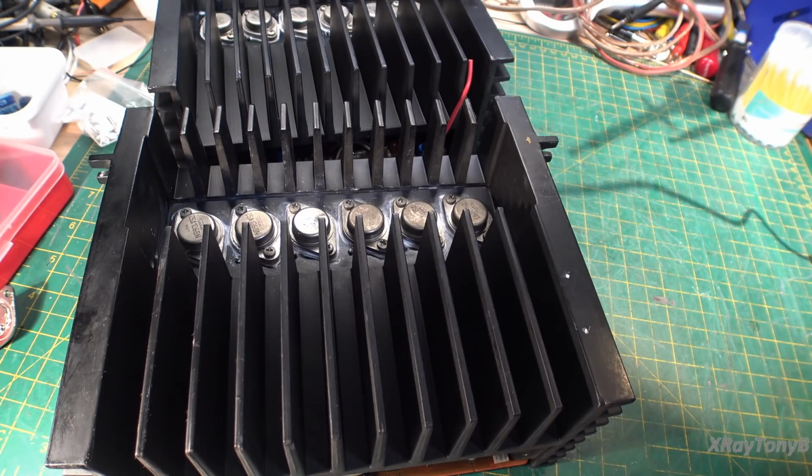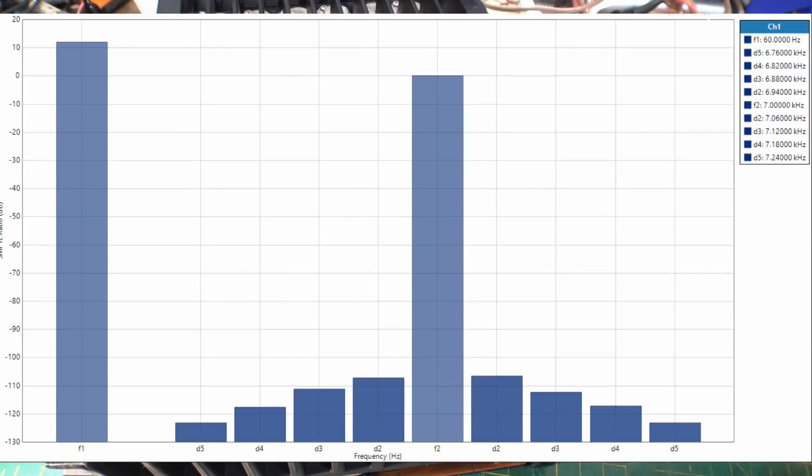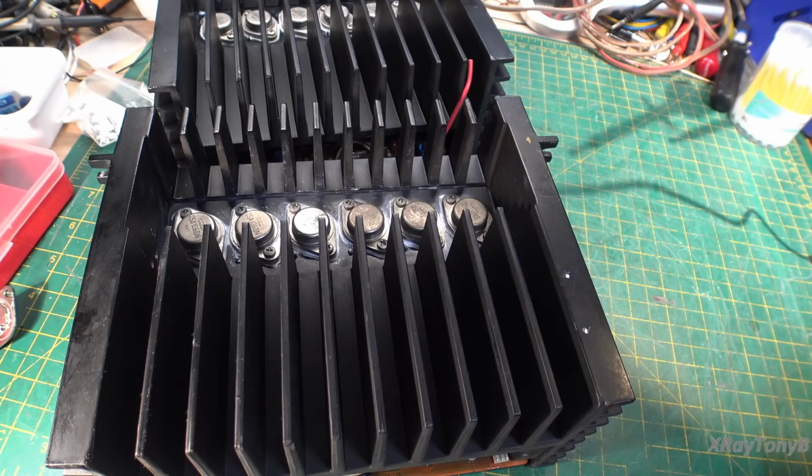And the low frequency is, I believe, a factor of 4 to 1. So one frequency is 4 times the amplitude of the other. And essentially what you're doing is you're measuring the spectrum on it and looking to see if it reproduces those two frequencies properly or if it makes all of these other harmonics that will show up as distortion. There's ways to test it. You really need the right equipment and so forth.